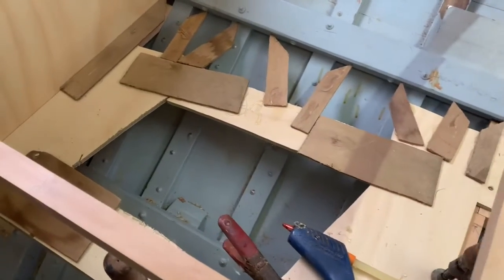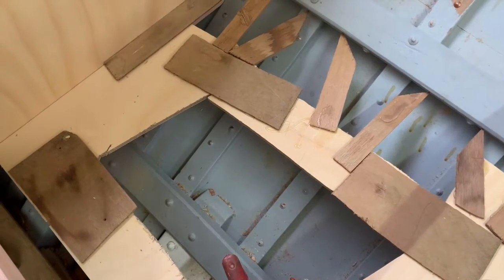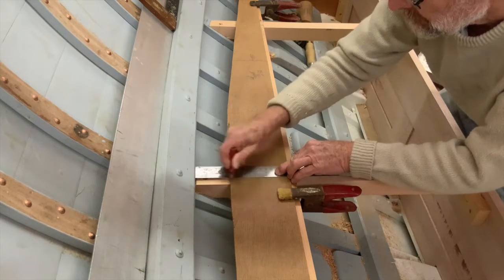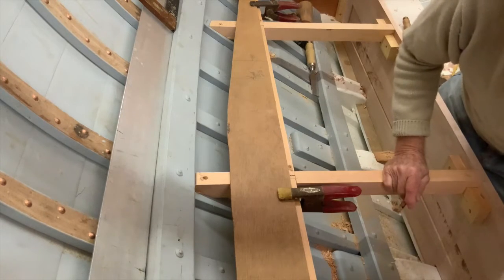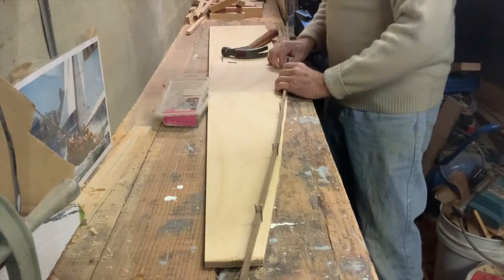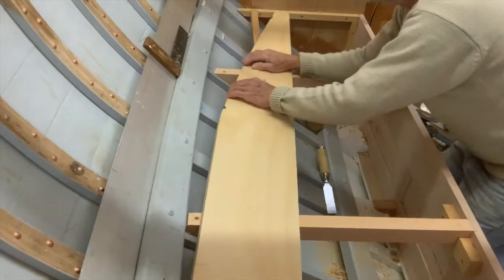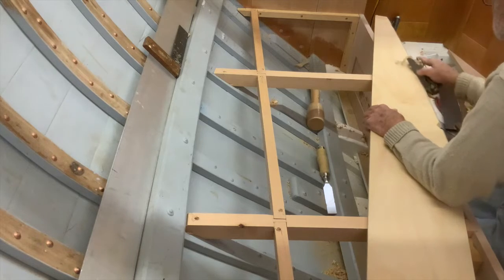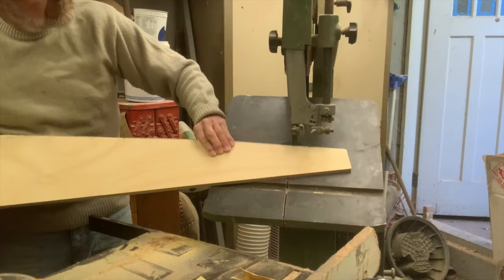Any vertical bulkhead and any horizontal shelf or bunk can be shaped by building up a pattern by one of these methods. This one is the galley bottom shelf. For more simple shapes like this narrow outboard bunk top section, I find it easier to simply mark equal distances off the hull onto a scrap piece of ply, then cut the marine ply a bit oversized and scribe and work it down. Don't forget there will usually be a changing bevel angle to measure and plane on the plywood.